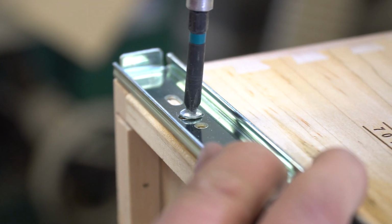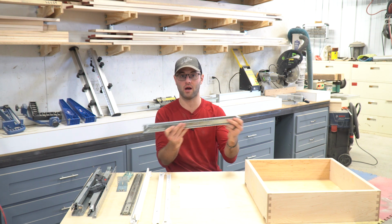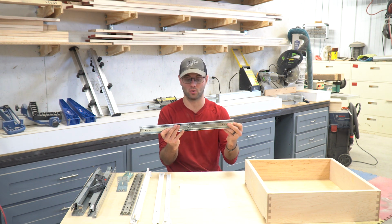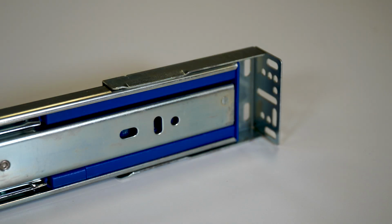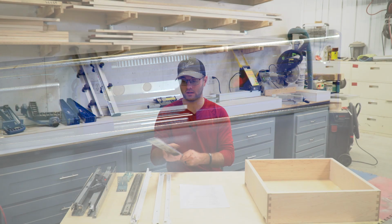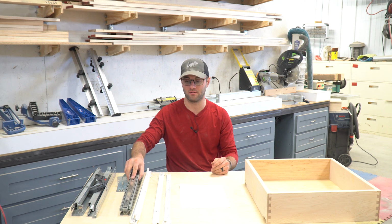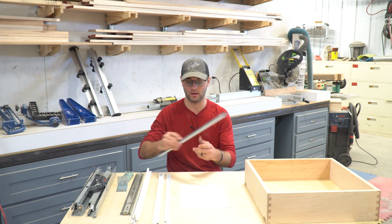You can just get a regular drawer slide. You can get stay closed, which basically means once you get it to a certain point, just like the epoxy, they actually will keep the drawer closed. And then you also can get the popular soft close. Tolerance when you're building your drawer in your opening, and the drawer, the soft close mechanism can kind of be a little bit finicky. So I have tended to graduate to the undermount slides, which we can get to here in a little bit.